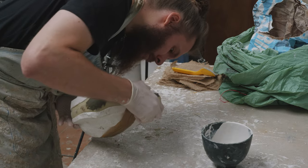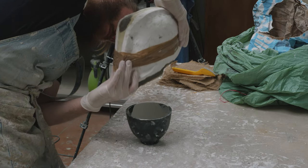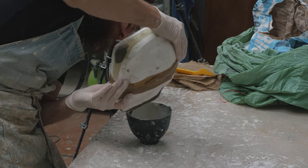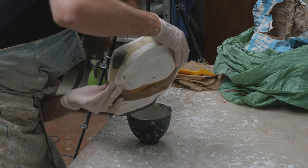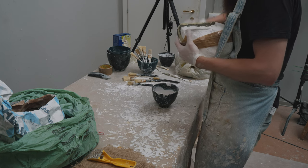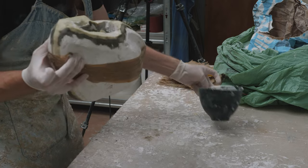As long as all those things are taken care of and you're finished with the first layer, now it's time to let the mold sit until we do the second layer. Plaster goes through stages as it sets up and becomes hard and solid. At first, before we mix it, it's powder; then right when it's mixed it's very liquid; then it slowly becomes a cream cheese kind of texture and you can still work it. Then it becomes crumbly like cottage cheese and you should really stop working with it then. Then it becomes firm but still soft, more like a damp cracker.